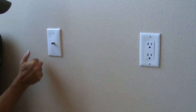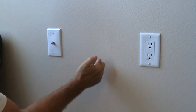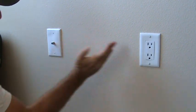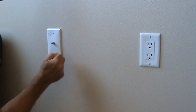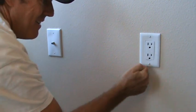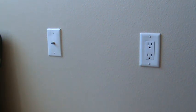You can knock on the wall too. Hear that? Higher pitch. A lower hollow pitch means there's nothing there — this wall is hollow in here, no stud at all. When I get close to a stud, listen — it's a definite different noise. Hollow versus solid, high pitch. It's kind of a feel. So there's another way to check — I'm going to show you one other way you can do it as well.